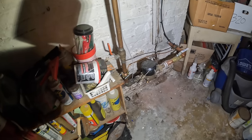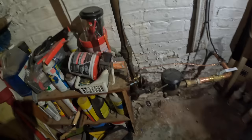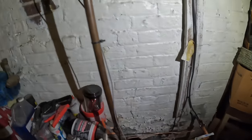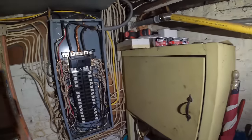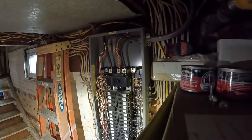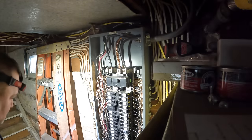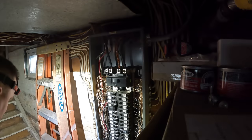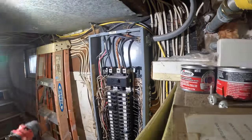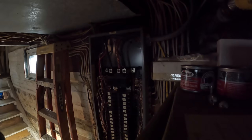There's the grounding electrode for the water main. That was done correctly. I believe that was done yesterday before I got there by one of Dominic's guys, not 100% sure. But what was happening was they lost their neutral from the utility, the people here, and some of that current was returning on the grounding electrode. Because as we know, current leaves the source and returns to the source, and so you just don't want to be a part of that path. Obviously, if it's flowing on your grounding electrode, that's objectionable current flow. That's not what we want.